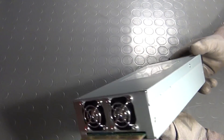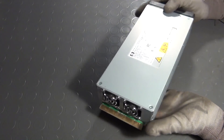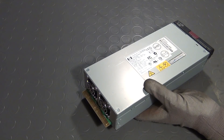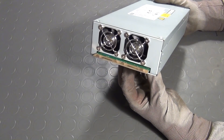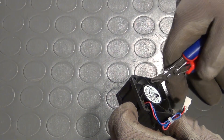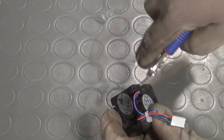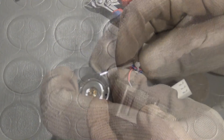The first thing for me to do was to look for very small but powerful brushless DC motors. This is a 750W server PSU. I bought several of these on eBay to salvage parts for power electronics projects from them. They only cost me a few bucks and every unit carries two BLDC fans. After removing the fans from the enclosure, I cut the motors out of their frame and removed the wings entirely.